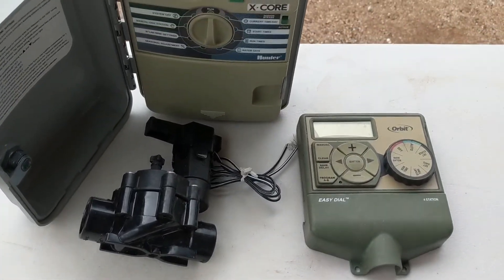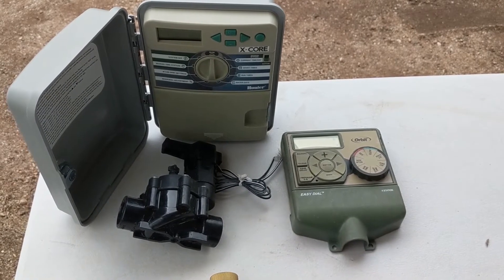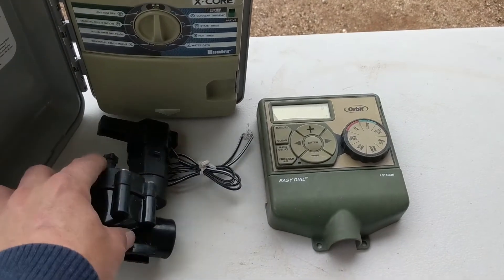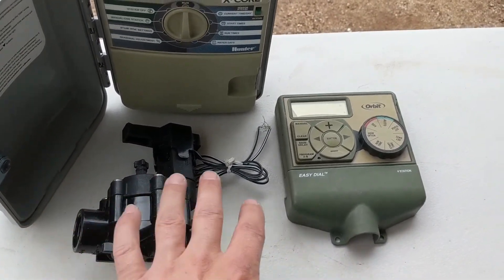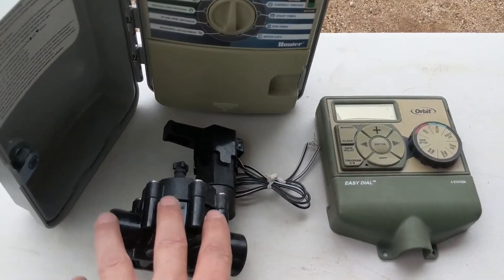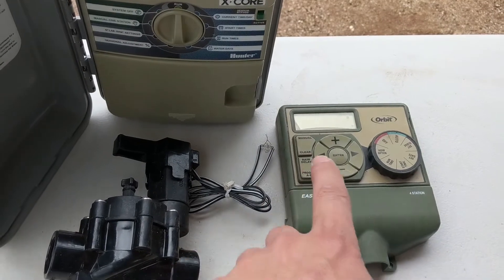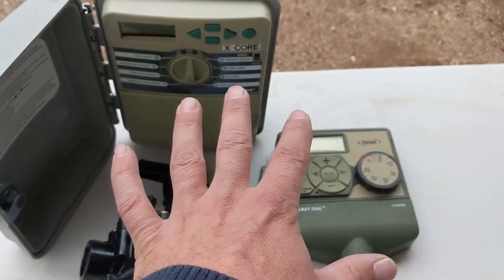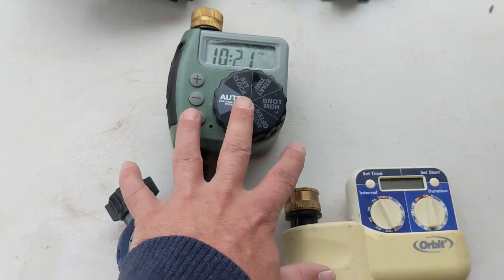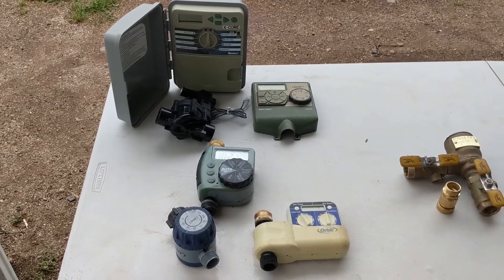For a larger landscape where you need to water multiple trees, shrubs, cactus, and vegetables, these more advanced timers give you greater flexibility. They connect to underground valves through underground electrical wiring — there's no plumbing directly attached to these timers. They turn the valve on and off through wires, so you can locate them anywhere on your property, attached to your house or even in your garage, whereas the hose-bib timers must be connected directly to their water source.